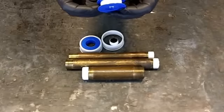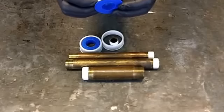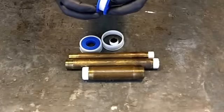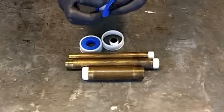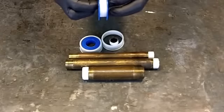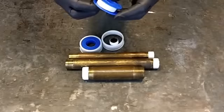They also make a pink version, which is a triple density tape. That's for larger pipes in big distribution systems — anything from two inch and above — and that's pretty heavy, like a 10 mil weight.